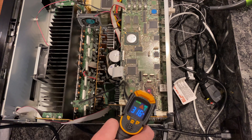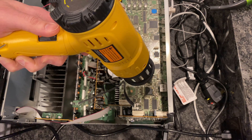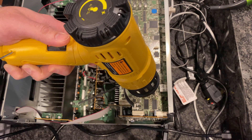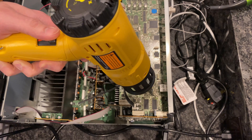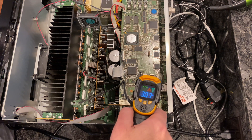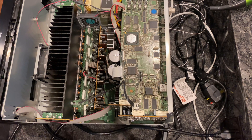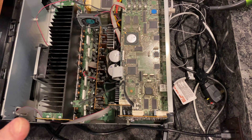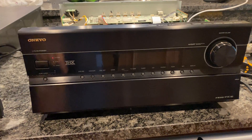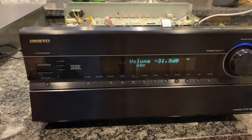I'm taking temperature readings — right now I'm seeing around 390 degrees. I'm going to give it a few more seconds because I'm seeing a little smoking too. I'll let that relax for a second. If that doesn't do it I'll try again and go a little hotter. Okay, I just did the heat gun treatment with the solder.